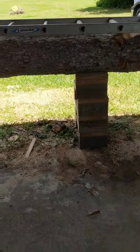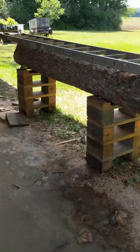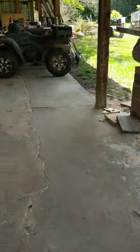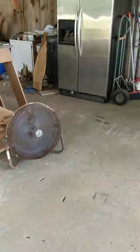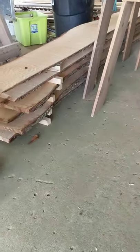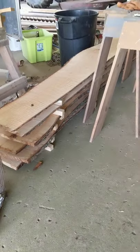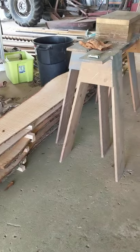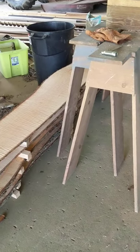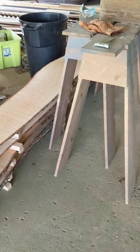If you're looking for a way to support your logs while you're milling, get them up high off the ground so you can work on them. I've just finished one pecan tree and I've got it stickered and ready to dry out. I'm just going to let them air dry. There are homes 500 years old built with logs that were milled right on location, and they didn't have a kiln nor wait the one year per one inch of thickness that some people recommend.